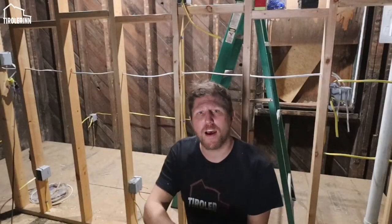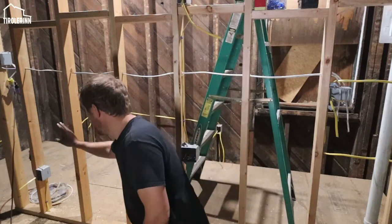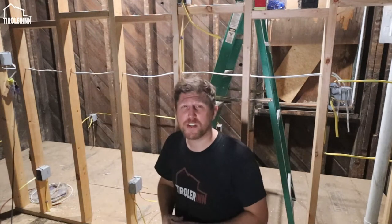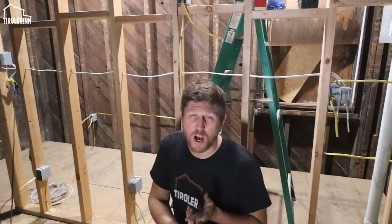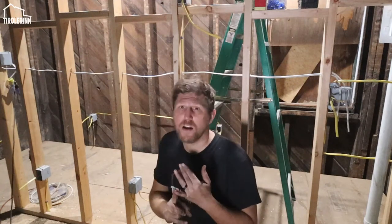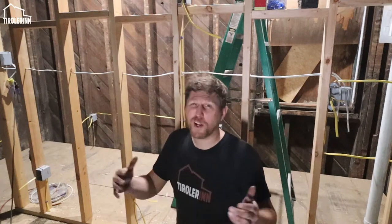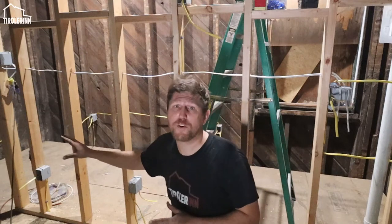Modern kitchens have a lot of different circuits that you need. You will need a dedicated 20 amp circuit just for the refrigerator. The reason is modern day fridges are getting more advanced. There's more technology in it: besides an ice maker, the standard fridge cooling and a freezer, a lot of the smart fridges have big touchscreen TVs built in where you can control your entire house. So, a dedicated outlet just for the refrigerator.